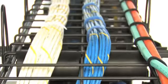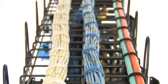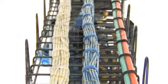The grid pattern on the Panduit WireGrid is larger than typical wire basket products, which allows for the cable cassettes to be routed through the bottom openings without additional cutting.